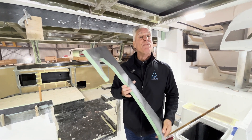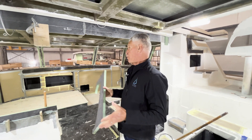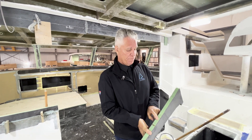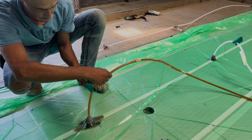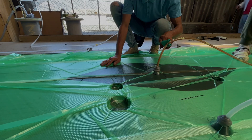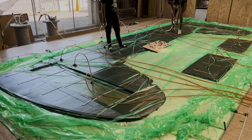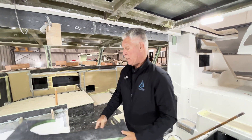So how are these made? All of these partition panels and bulkheads — we take a foam core, and we have a vacuum table where we vacuum bag — actually infuse — all of these parts. It's called infusion. You get a really clean, lightweight laminate on these things, really really light.